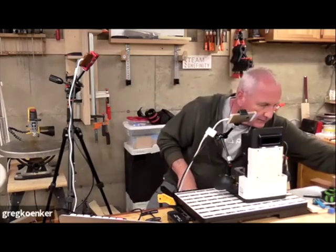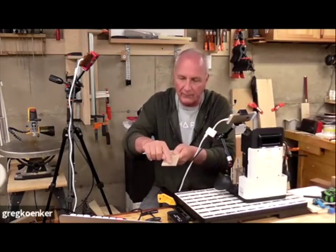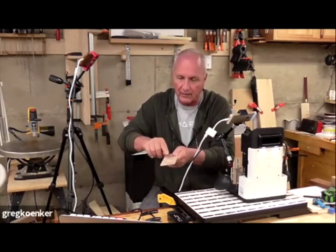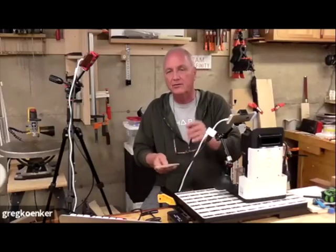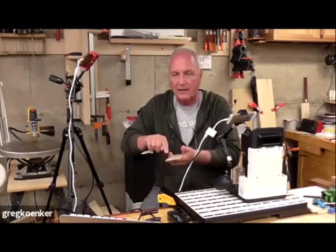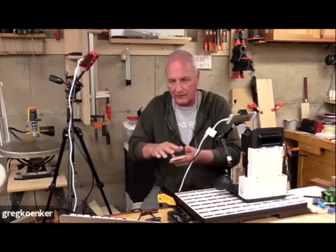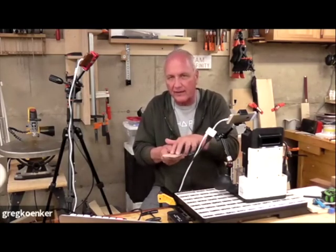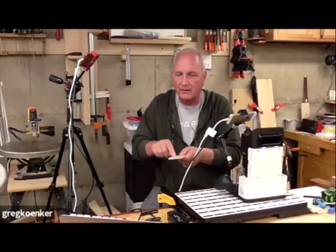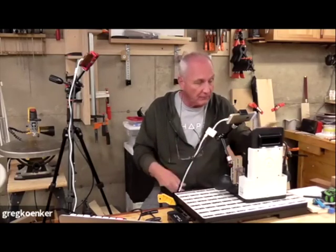If this were the slab, I cut a piece out like this. And then I think I might have cut it the whole length of the piece. But I cut an additional part out here, and I was able to get it because I did it using the software. I programmed the piece in and what cut I wanted on it. I sketched out the lengths and distances and translated it a little wider than I needed to, but because I had that in the CAD software, I was able to then create the inside piece to go in there to replace it. And it just fit perfectly.